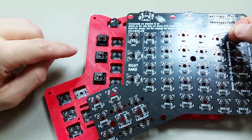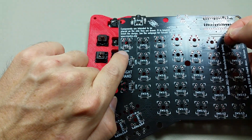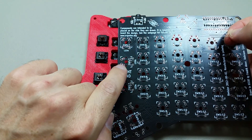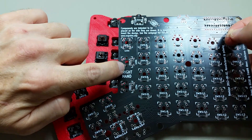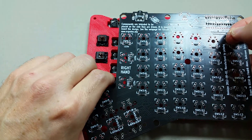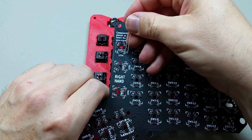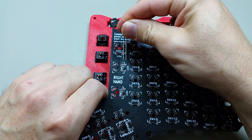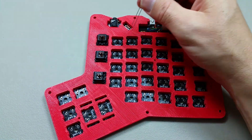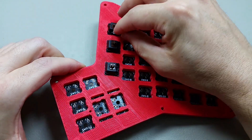Just so you can see — this board is the same size as this one. You have the round through holes and then the square through holes here. Square, round, square, and round — you can see they're labeled LED. So these will actually get connected here. The longer lead on the LED needs to go to the square side, so it's going to go in like that. And there are slots in the Cherry MX keys where they can go through like that.